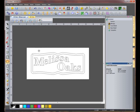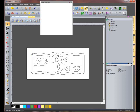So now let's click on our graphics window to close the Tool Settings tab and click on our Select function so that we can select the vector we just created. We're now going to use a Block Copy Rotate function to copy this around the sign.